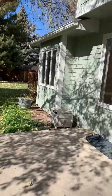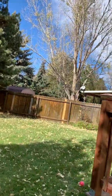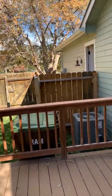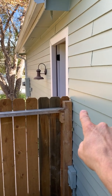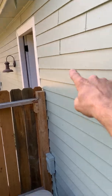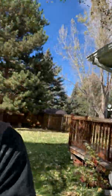As another example, there's also another area that has that issue — they decided to convert the walkway into a garage. There's that light right there, which you'd think there would be a switch inside this wall, but there's not. It's actually on the other side in the garage on a wall, because they converted that room too. You could do both of those — you could get them to be dimming, but you don't need to dim outside. Maybe you do for your neighbor. Just get the right dimmable bulbs. That way, you don't have to run switch legs and actually destroy your drywall.